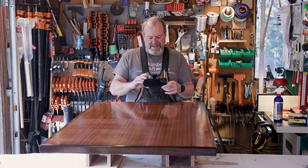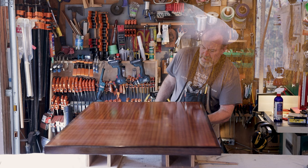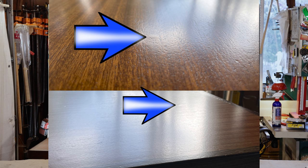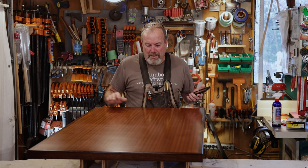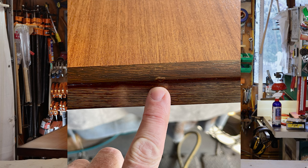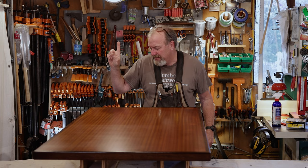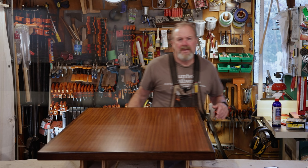There it is. You can see it's drying — it has these little dry streaks in it, and some little white light spots. All these little spots I'm showing you are where the glue was. I'm going to let this sit out here for 45 minutes and come back in a little bit. It's been about 45 minutes and it is fairly dry. It looks okay — it looks a hell of a lot better than it did when it got here. You can see where we added the glue. There's a little bit of a bump — I didn't sand it good enough I guess, but I'd rather have a little bump than a divot. There's a couple spots where we put the accelerator in first and then added glue and then accelerated over the top — it seemed to work out pretty good. It's very smooth and sanded out well. We had a huge gash at the very end that was very deep and you can't even see it.